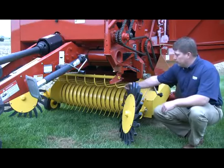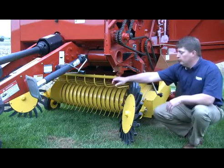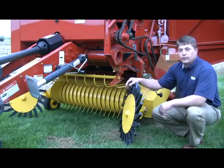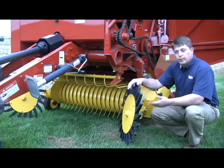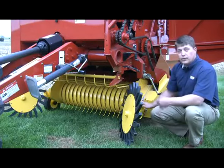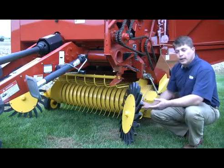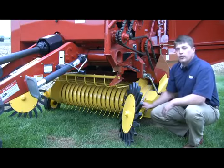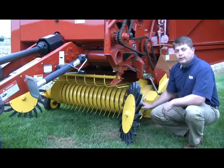The wind guard is easily removable — you can simply pull this plate out of the way and slide the wind guard right out the front of the baler. Gathering wheels are going to be an option on this baler. They're mounted to the pickup itself so they follow the ground very well, and they're going to help you gather those bulky or wind-blown windrows and feed them right into the bale chamber so you make nice square-edged bales.